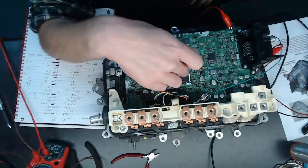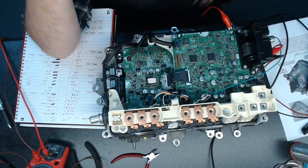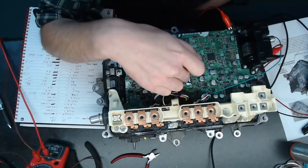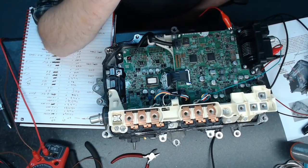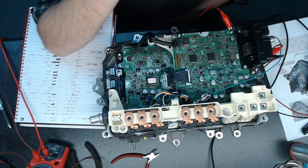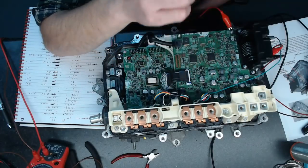I need to find that plug and make a breakout board. But the only other way to do it is to try cutting some of those tracks on there. And the problem is, it's most certainly a multi-layer PCB. And they drop onto vias very near. Now, I could certainly cut some of them, probably a few of them, sufficient that I could inject my own signal in there, which would be probably the next sensible thing to do. Or, better still, if I could find where they go in some other part of the circuit here.